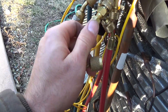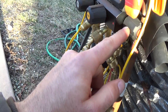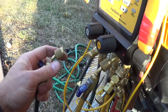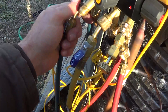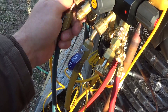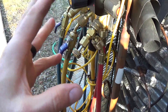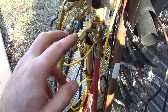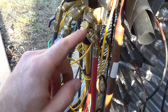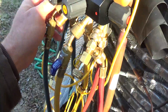When I'm ready to disconnect, I open this up so there's a bunch of liquid in here, open my manifold back up, and run everything through into the low side. You're getting all the liquid out, and you can take this off without getting that spurt of refrigerant — which sucks in the wintertime. The older I get, the less patience I have for frosted fingertips.